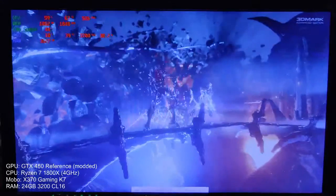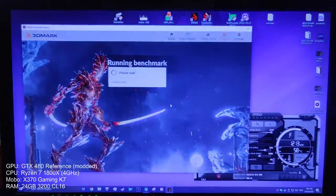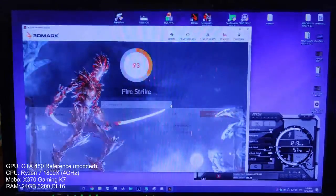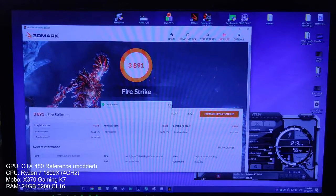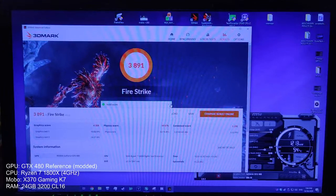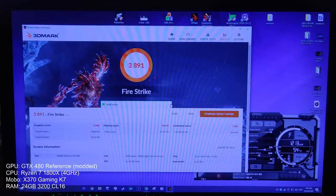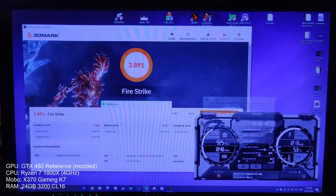480s are good about not crashing due to temps. Should be able to hit 100C without issue. Yeah, I mean, they will hold. They can run at those temperatures, just not if you overclock them a lot. At least on 580s. I don't know how Fermi 1.0 is for that. If you were just telling me that they can run high temps, then yeah, I mean, 70 degrees is already pretty high. Some of my 580s would complain at that point.